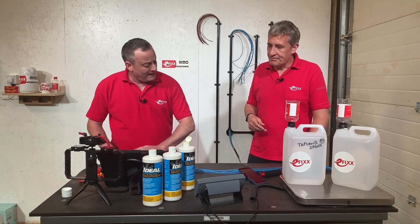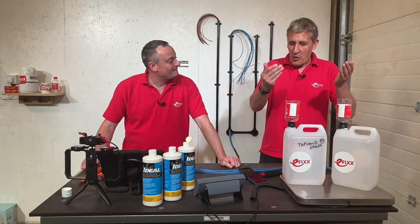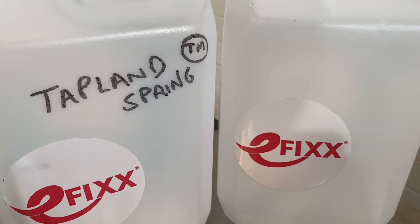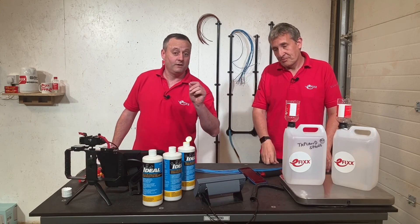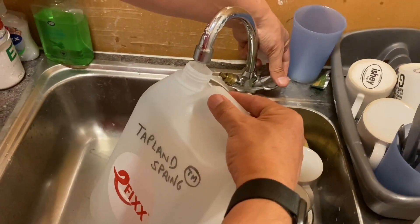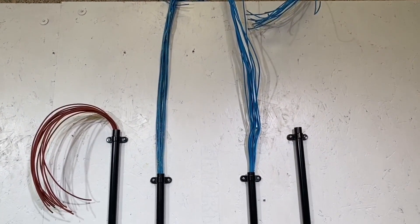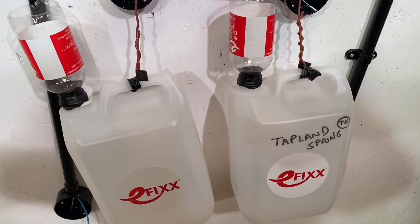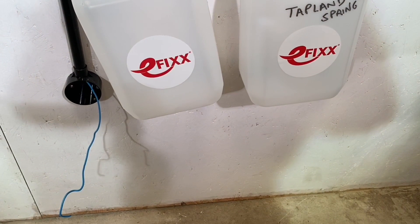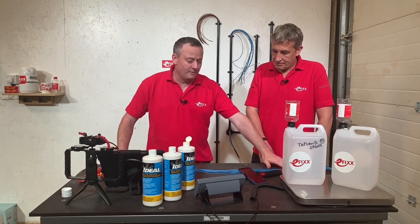We're going to take some of this and lubricate the cables. In order to do a fair test, we've created two weighted water bottles that we're going to attach to the ends of the cable on the rig and gradually fill with water, seeing which one pulls through first. The rig will have 13 x 1.5mm² cables suspended at the top. One set will be lubricated and one will not. They have to go over a bubble set, which adds resistance, then down to the bottom where the containers fill with water — when pulled through the bubble set, the bottles will hit the floor.